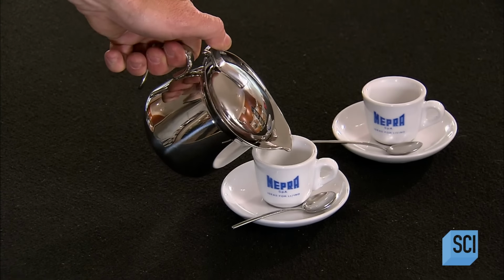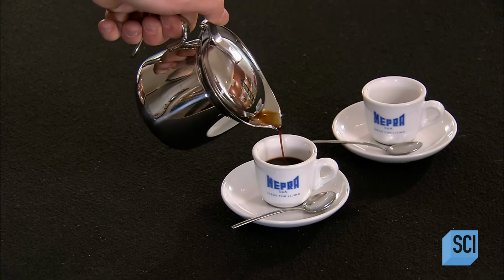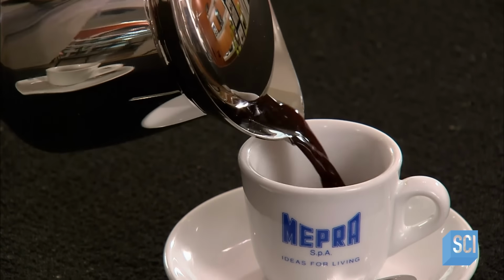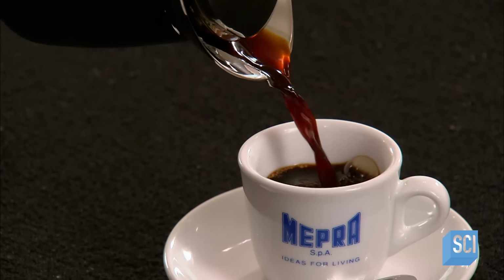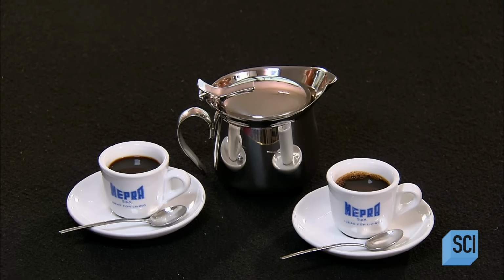The trick to a thermal coffee pot is in the construction. Both the body and lid have a double wall, 2 layers of stainless steel. Between them is a tiny gap, just 5 to 6 millimeters. The air in this gap insulates the inner wall, trapping the heat inside the pot.